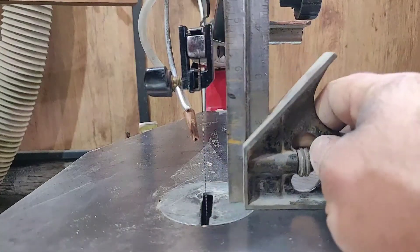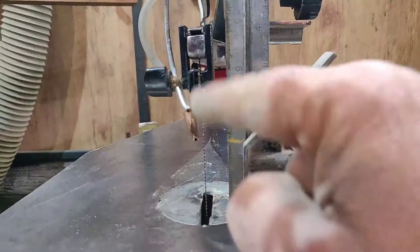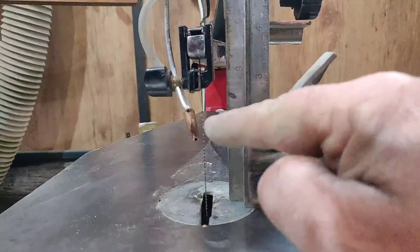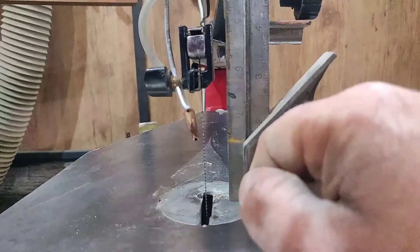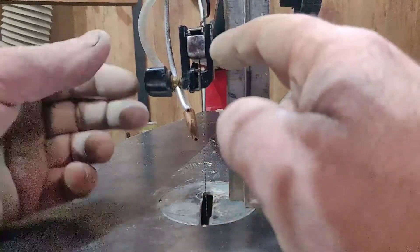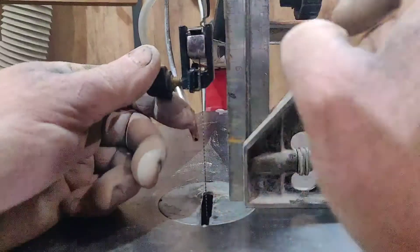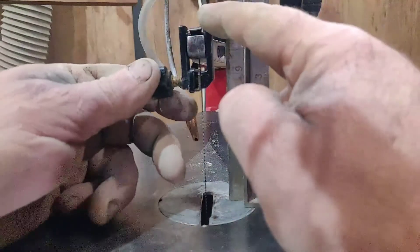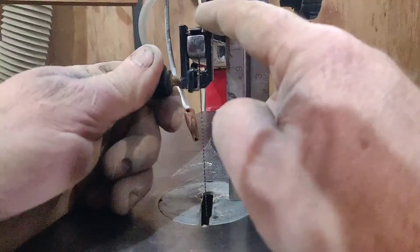What that's doing is crabbing the actual pinless blade — the top holder is not in line with the bottom holder. So we're putting a crab onto the blade; we're twisting the blade, trying to bend it to make it run true. This should be a fairly easy fix. What I'm going to do is remove this blade holder, and where it sits into a little groove in the top of the arm, I'm going to file one side so the holder sits straighter, more in line with the blade. That should take out some of the vibration.